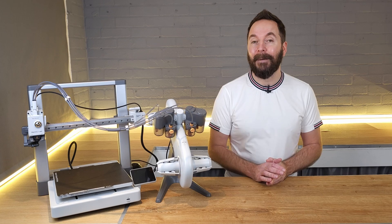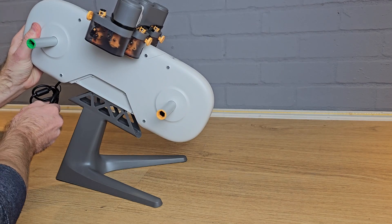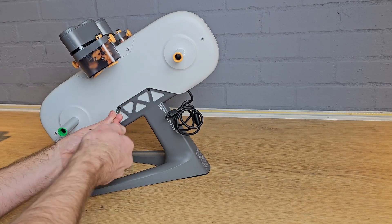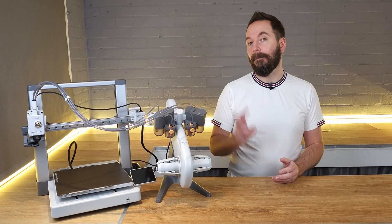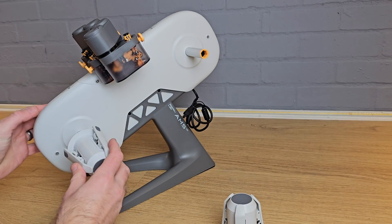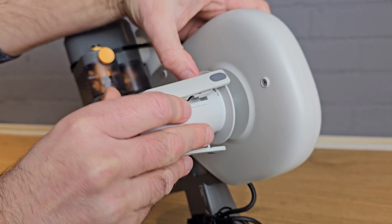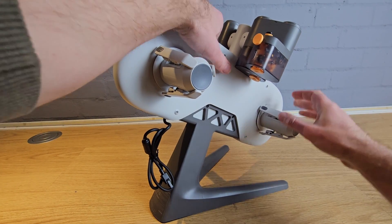If you have the AMS Lite then now is a great time to assemble it. Start by sitting the AMS body onto the stand and then hold it in place with the four screws from the bag labelled for AMS stand. With all four screws tightened, find the spool holders and note the colour coding on each one — you should have two yellow and two green. The green ones slot onto the shaft with green on the end and the yellow ones match with the yellow shafts. Slot each one into place giving it a firm push until it clicks home. If any of them don't locate easily, rotate the spool holder until you feel it start to push in.